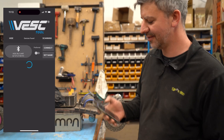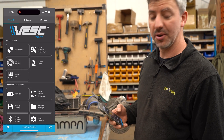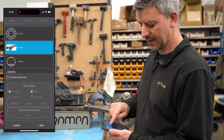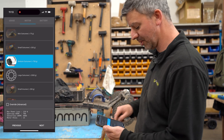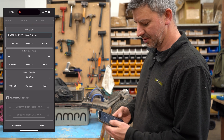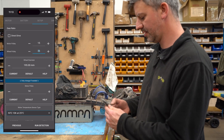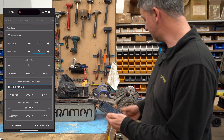Board on, connect. Firmware update available — okay, because we run 6.02. Set up motors. E-skate — make sure it says 85%. Next. Medium outrunner — Tramper motors. Next. 12 series, 20,000 milliamp, Lipo setup. Next. Then we have 15, 76, 195 — it is an 8-inch wheel.